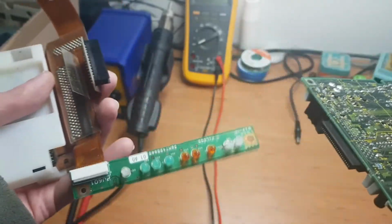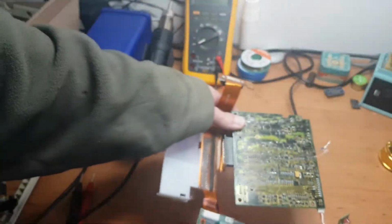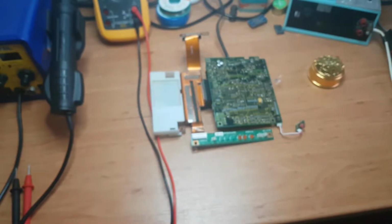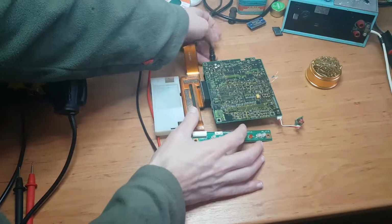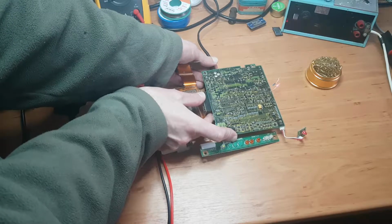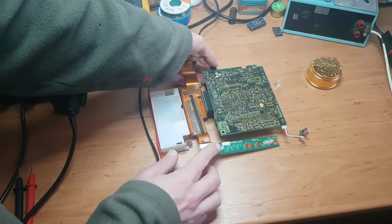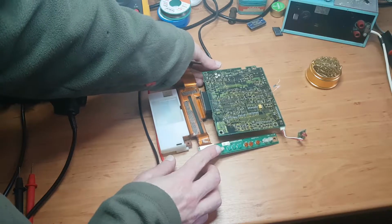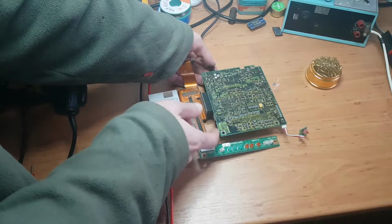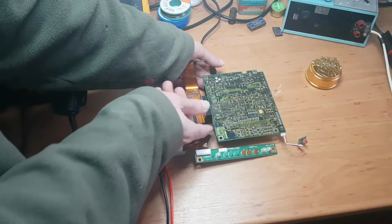So when I connected it to the LEDs and powered it on, actually just let me try to show you. Unfortunately, the DC in connector has gotten worse over time, so now it just doesn't really want to connect at all. But now, when I connect the power to it, well, you could probably see it there for a second. The green power LED, which is connected to the 5 volts VCC output of the power supply, lights up for a second. And when it's connected to the computer, there it went again.